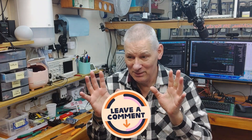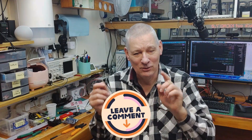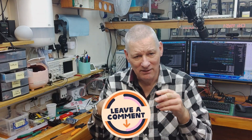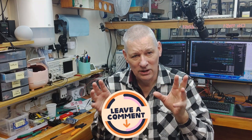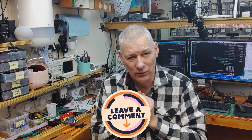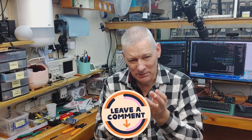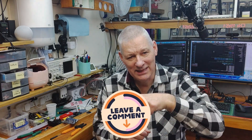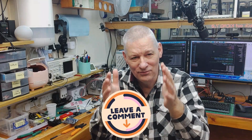If you've got any comments, or you think you could have done things differently — remember I spent three days sorting this out — please leave them below. If you've had this problem and solved it, or if you've got a version of the ESP32 — a Feather, S3, C3, anything — that works with WiFi and NeoPixels, tell me what library you're using. I'm using the Adafruit one, but the FastLED library also has those issues, so there's something fundamental about NeoPixels — perhaps it's the bit-banging of the signal.